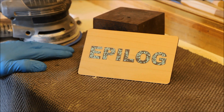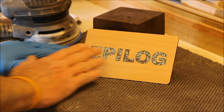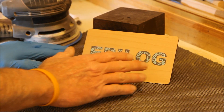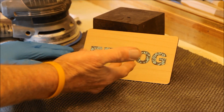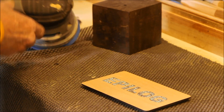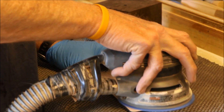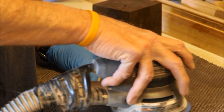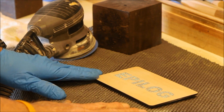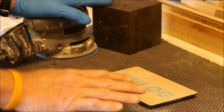This is a continuation of the project — I've already sanded it. I have the luxury of a drum sander, which took off the bulk of the overpour at 80 grit. I actually poured too much and it was too high. Now I'm going to work through the grits: 180, 220, 320, and 400.